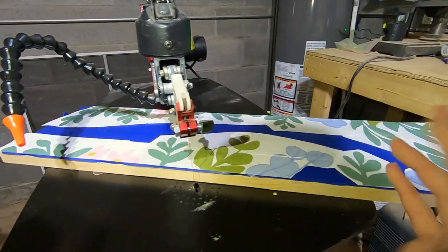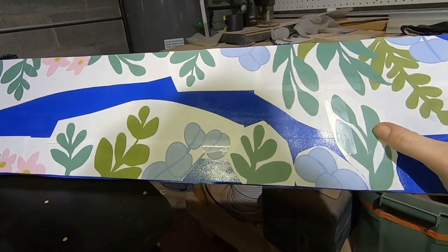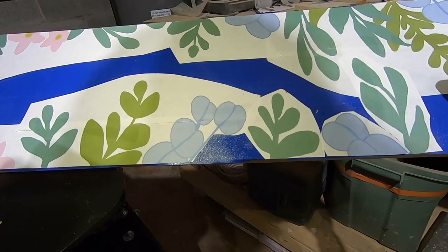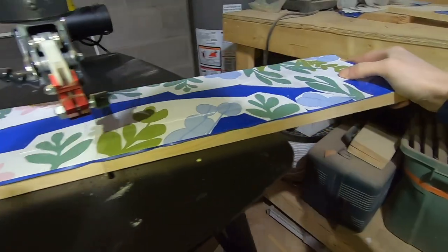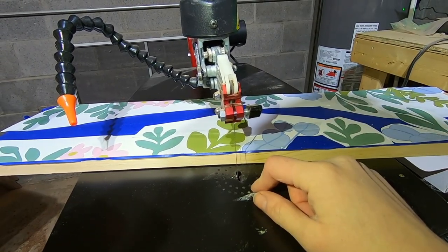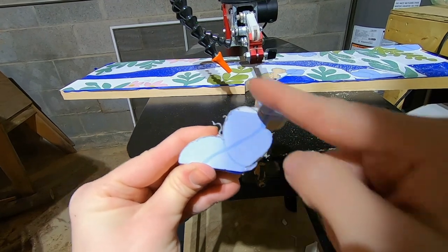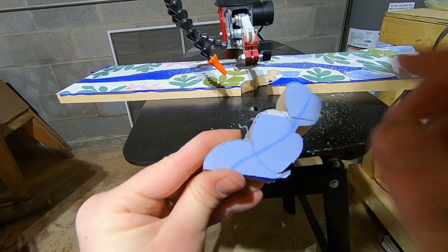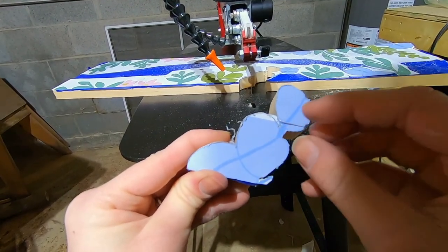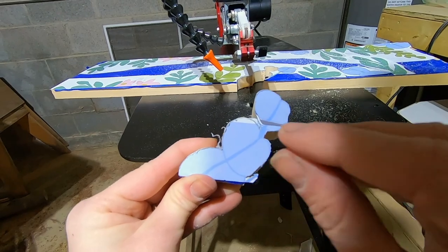As I cut, I'm going to separate them into piles based on color. Because I made the template, they're already basically the general color that I want them. So I'll be putting all the dark leaves together, the blue ones together, the light green ones together — that way when I go to finish them, I have an idea of what color of stain or paint I'll be using. I'm also using a number five modified geometry blade, the same one I used on the last project. Feel free to cut those out separately individually — it does take more time, however it would look really sharp if you did some added shaping. Because of time and budget on this project, I'm going to keep them together. I am going to create that depth and texture later with a Dremel.